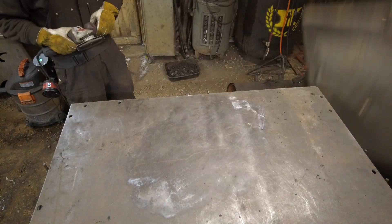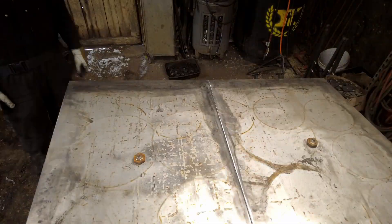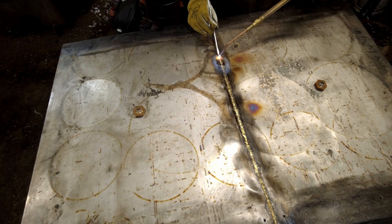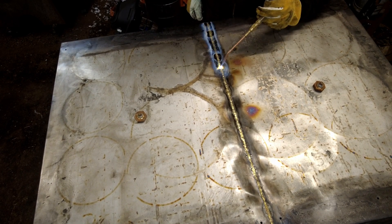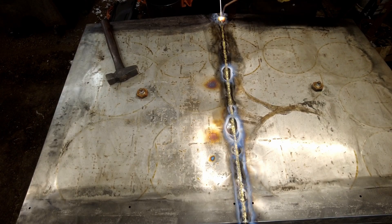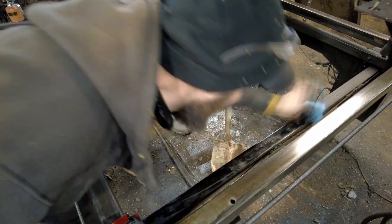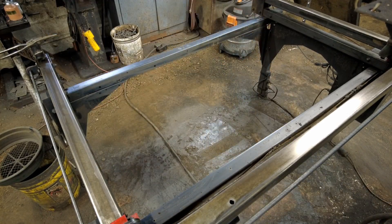Mine started leaking from moment one. I did everything right by the instructions, put everything together to the letter — I don't make this kind of purchase without doing everything by the book. I did everything exactly as you're supposed to and it started leaking day one of use. This pan is completely faulty. My suggestion is, if you can't braze it like what I've done in this video or have it TIG welded together, pay a fabricator to break you up an actual pan to fit this that is much sturdier and won't have the leaking issues. The water pan is garbage.